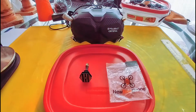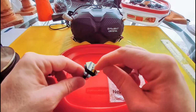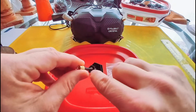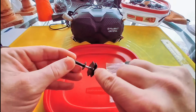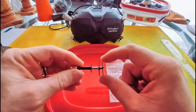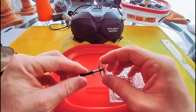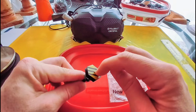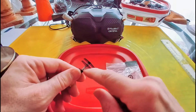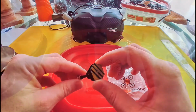Hey guys, just one more thing I forgot to mention. So when you're soldering this up, the positive pin is here, but on the back side, this is a negative, this is a negative, and there's even a negative on the top plate that you have to solder to the antenna stem or the coax cable. So make sure you don't forget that. So top pin positive, bottom panel gets soldered to the antenna stem / coax cable negative. Okay? Thanks.